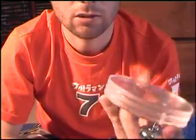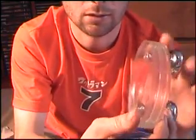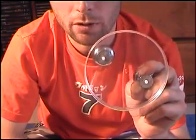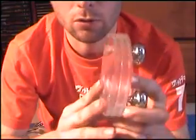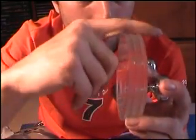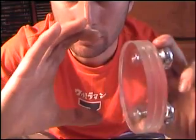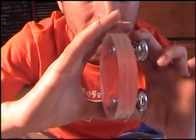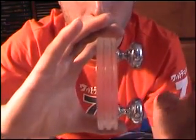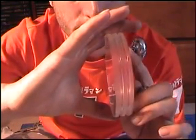For the double seal insert, you want to get 20mm thick perspex cut to a circle the same outside diameter of the pipe, same as you did with the front end where you look through. You also want a taper or to be rounded, only slightly, so when you insert it into the pipe you don't have to have it exactly straight when you push it in or pull it out. Because if it has a snug fit and kinks slightly in the pipe, it will jam if it's a perfect fit.